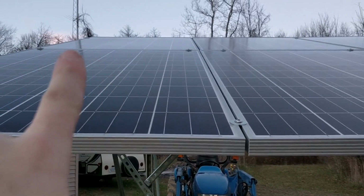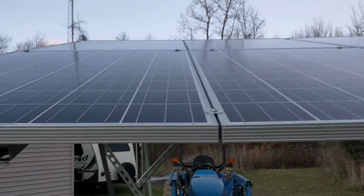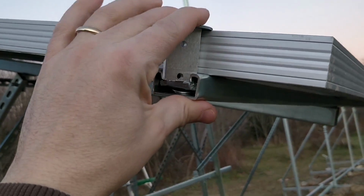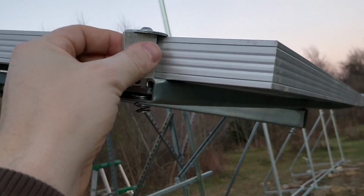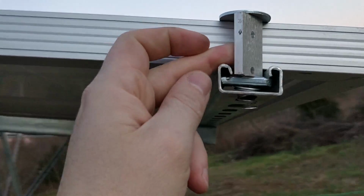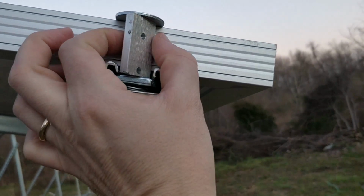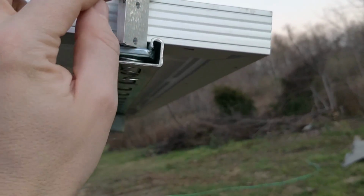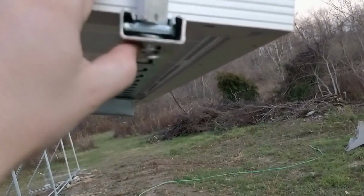You can see I've done that up there for the middles, and at the top. But these that are on the edges, I need to do something better. I just put a spacer block in here for right now, and they're okay, but I'm sure that with heating and cooling, sometime those are going to wiggle free, and I don't want that, so I'll have to figure out something better. My thought is maybe a piece of aluminum angle iron, tiny, that will fit just over that screw and take that place. Or fashion some form of an L clip that this screw goes through a hole in the top of it to clamp down, but we'll see.